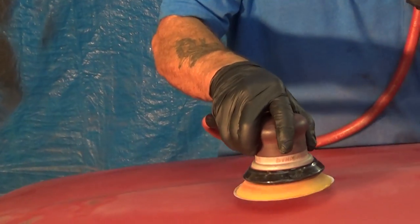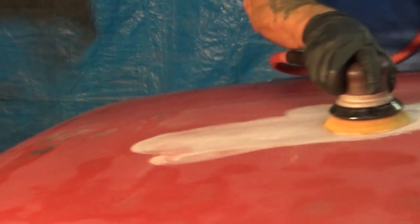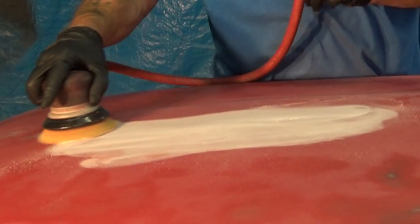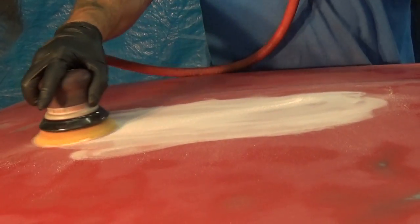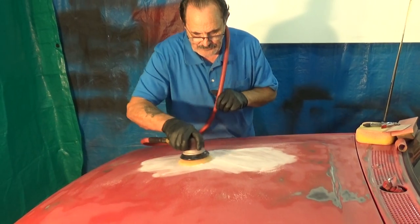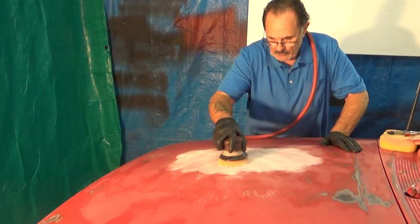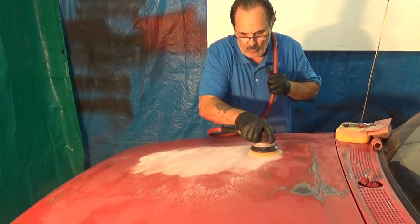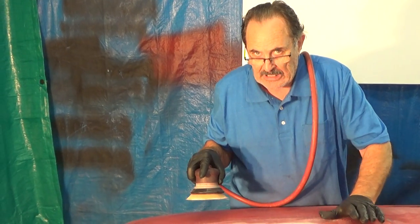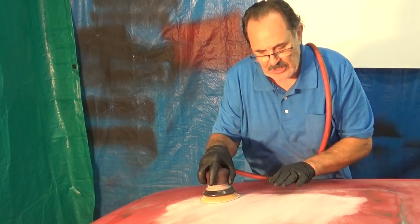I'm going to start right here — I've got a place that needs working out. There are a couple of little divots that look like something left tiny scratches. I know the primer will fill it in, but I want rid of that so I don't have to worry about the primer filling it in. See this angle right here — work it at an angle across that area, then come back and work it the other direction. What it amounts to is: when you cut at these different angles instead of one direction all the time, you avoid leaving grooves and high and low places. This assures you're cutting evenly going one direction and then the other.